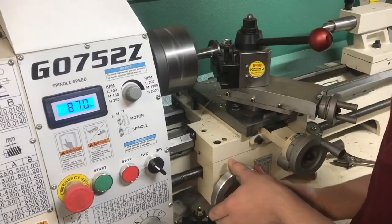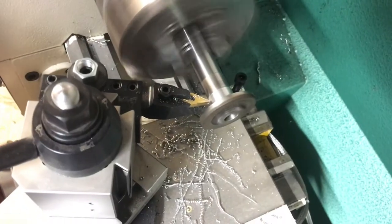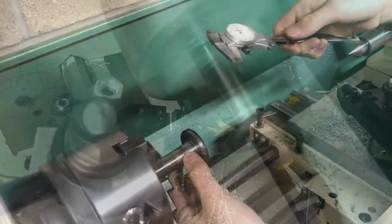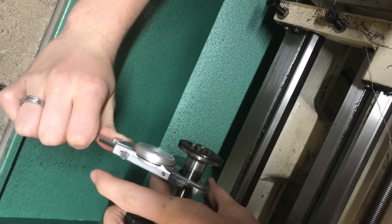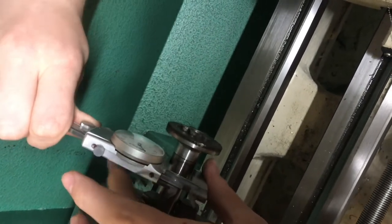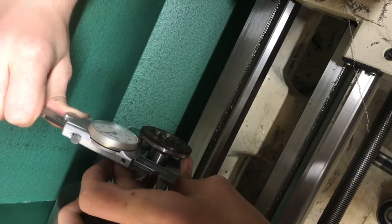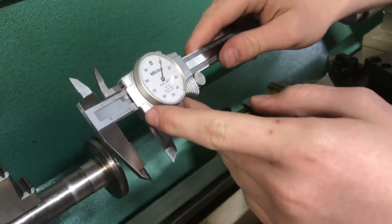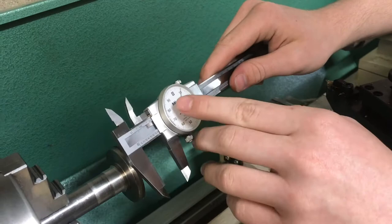The material appears to not be hardened. I've got these diameters a little bit closer now. I'm going to measure this one — that's right at 797 thousandths. This other one is 810, and I know I can take 20 thou without going over, so I'm just going to take 20 thou. That leaves about three thousandths of allowance, and from there I'll just file it.